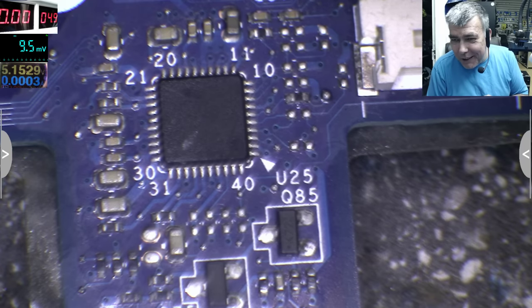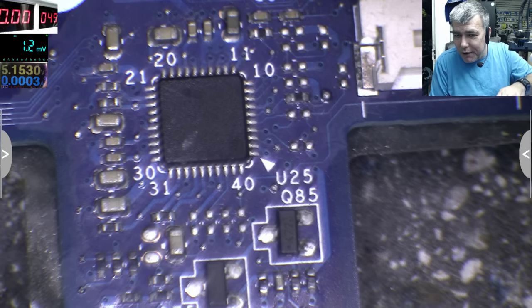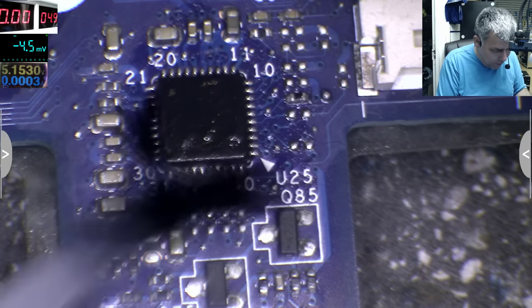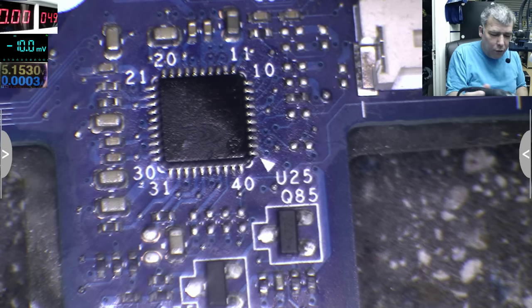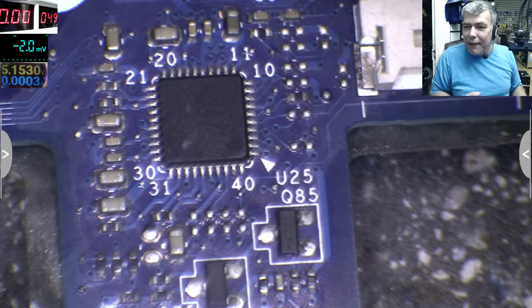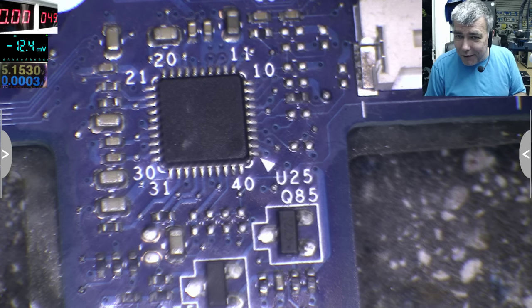You see — that's a scam. You think it's flux, but this is pure alcohol and it obviously gets evaporated. There's no flux. Again, it's getting evaporated and nothing is left. My real flux contains rosin and alcohol — when you use the flux the alcohol evaporates but the rosin stays. But with this one, nothing is left.